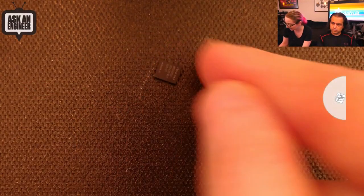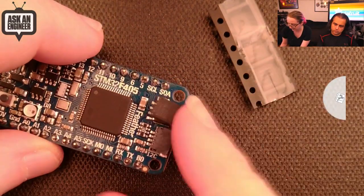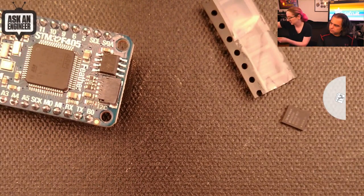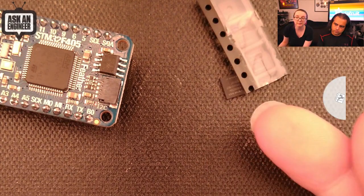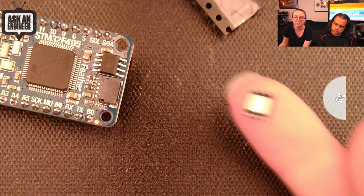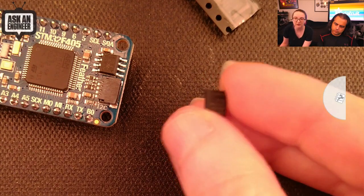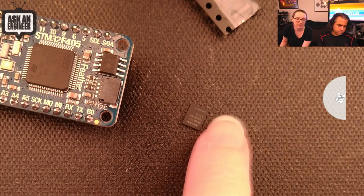This is what it looks like — it comes in tape and reel. It's SOIC packaging but actually more of a DFN. I brought a board that has a QSPI flash on it and you can see this is the same footprint — just a little flatter and thinner. These I think are two megabyte... actually it says eight MB. I don't know if that's eight megabyte or eight megabit — probably eight megabit, so one megabyte of data. Watch out for that: RAM is often specified in bits, not bytes, so divide by eight to get kilobytes or megabytes. It's amazingly small and thin — especially for CubeSat or high-altitude ballooning, this could be a really nice, low-cost, easy-to-use chip with a ton of storage.